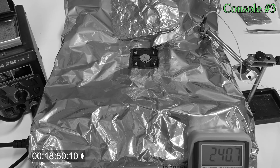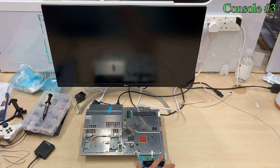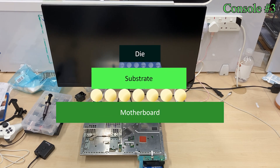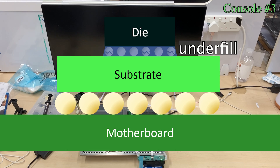I really hoped that simply re-flowing the processor could solve the problem. Unfortunately, it's not. It becomes green light of death instead. Assuming my reflow was successful, the problem seems to be in the underfill. So doing an RSX swap is the only way to fix this console.